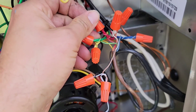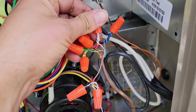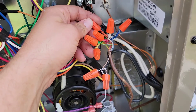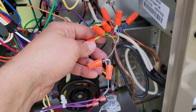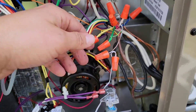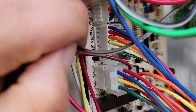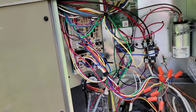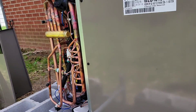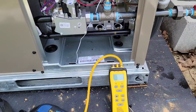I've got this wired into the brown and the black going to my thermostat. For the wiring: we've got our red and common, which is our 24 volts. We've got our white, which is our call for auxiliary heat — that's our gas heat. We've got our orange wire, which is the reversing valve. Yellow wire is a cooling call. We've got our green wire for fan call. And that right there is where the plug is for the 24-volt wiring going into the board.